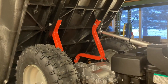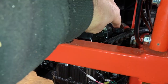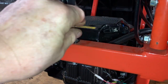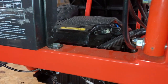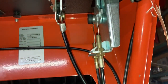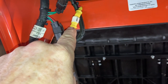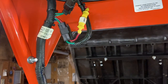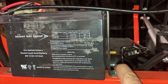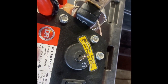All the ironwork on the bridge and the tilting mechanism — and there is a backup pull rope if you lose your battery or left something on. Is it the most convenient thing? Maybe not. But when are you ever going to use it? The point is, it's a back door if you ever needed it, and it's there. Now here's kind of a downfall: guys at power equipment dealers kind of frown on these differentials. This is a three-speed forward, one reverse — something you might see in a Craftsman or Ranch King tractor. It is a sealed environment; you do not drain it. It's non-serviceable.